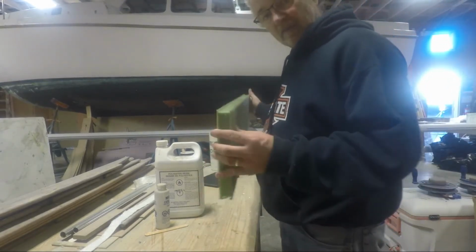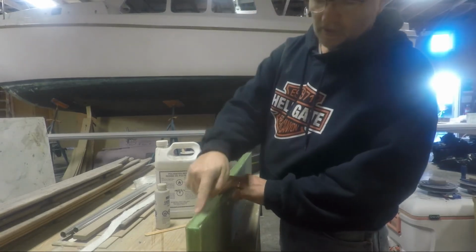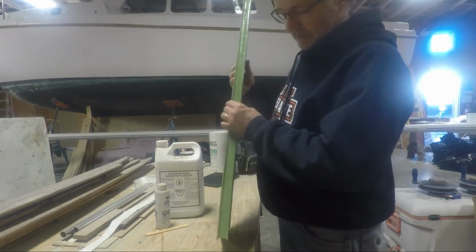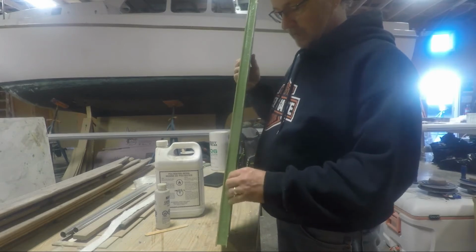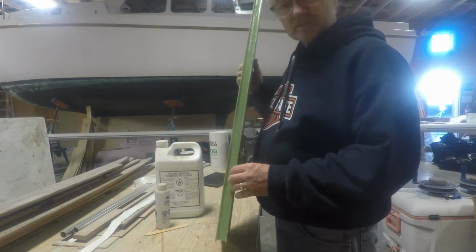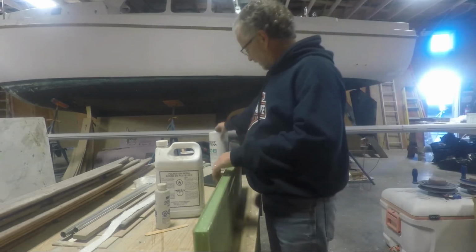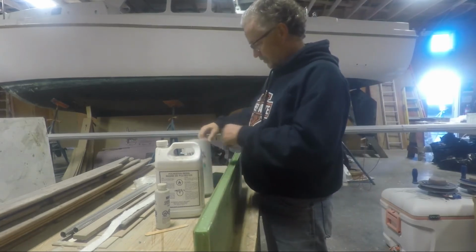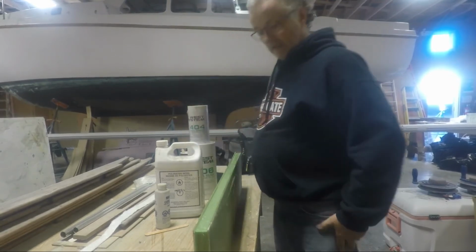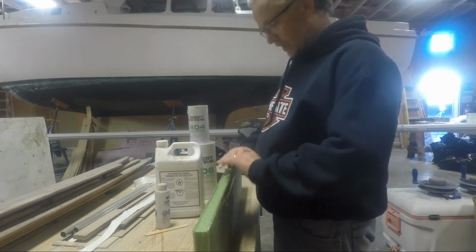the edge of the seat through the table saw to make it square, and then I created a 1/8 inch divot, if you will, I don't know what you call it, on the table saw. I just ran it back and forth through the table saw to create a trough, and I will fill this up with bog. Bog is a mixture of fiberglass and whatever else you can get in there, like adhesive filler. That's 406 West and 404 adhesive filler and whatever else I can find. And that will strengthen the edge, and it'll also give me enough bulk to be able to round it off.